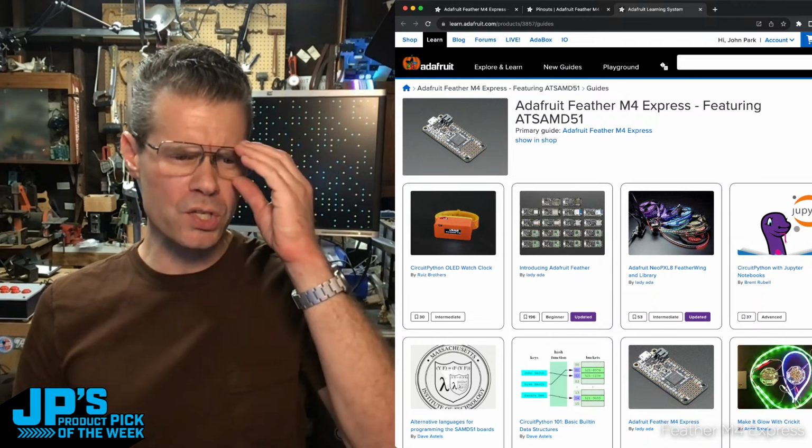I believe this also is one of the boards that you can run the Teensy audio library inside of Arduino on, since it's an M4 chip and we ported that. You should be able to use the Adafruit fork of that. I don't know if I can confirm that. I don't remember if I've done it. I've done it on some other of our M4 products, but it might be one that you could use for that. In case you don't want to use SynthIO on the CircuitPython side of things, you could use Arduino on that. And like I said, you've got a pretty decent stereo analog output right on the board, or you can, of course, use I2S if you want to plug out to a really high-quality amplifier.